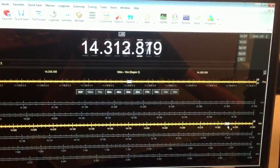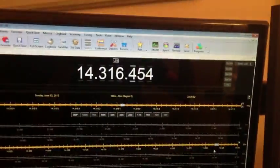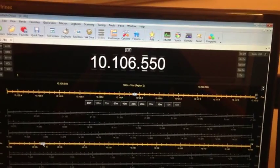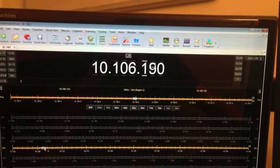It's pretty late at night for robust 14 MHz propagation. The antenna I'm using is a wire going into my ceiling — it's a dipole, a very crude dipole whose lengths aren't really measured. Let's drop down to 30 meters, which is restricted to Morse code.